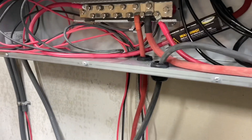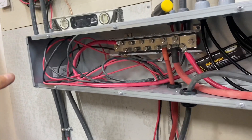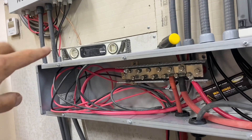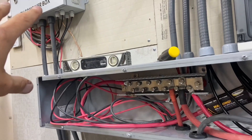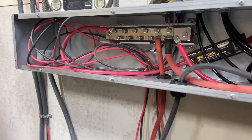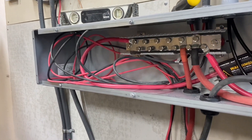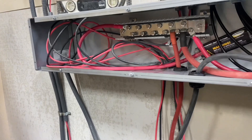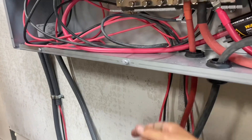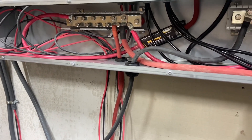So the PV is still a little messy here. I've got a combiner box up here, and I'm actually going to be moving that combiner box to put a spot to test inverters right there. So I'm going to have a little test spot to test inverters at some point. So I'm going to move that so I have extra PV here, and I'm going to be stretching all that in that direction. And I'm going to put a disconnect back there. At the moment, I don't have these in a conduit yet — any of the PV wire. But that's about the messiest part of it.